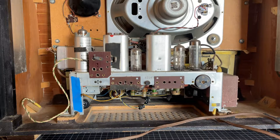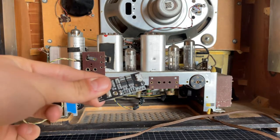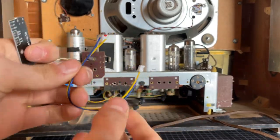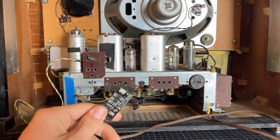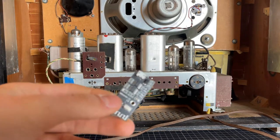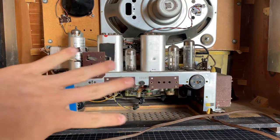There are two ways we can go about connecting this Bluetooth module to the radio. The way this thing works is that it has two headers, each one for one speaker. So this cable plugs into the Bluetooth module and goes to one speaker, and then the other cable goes to another speaker. This module actually has its own built-in amp so it can power fairly small speakers, however I'm not sure about large speakers since we're going to be preserving all the old stuff in the radio.